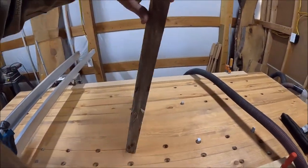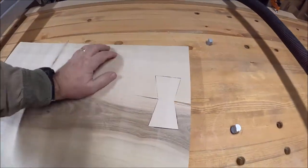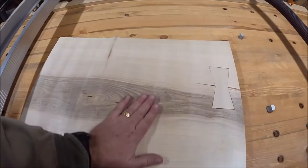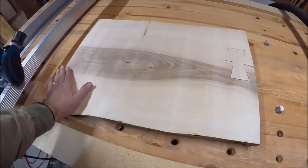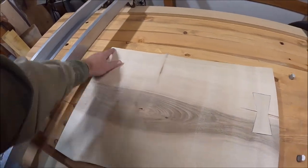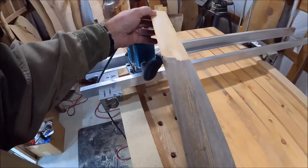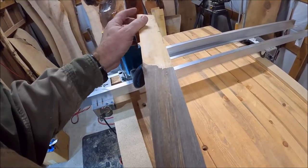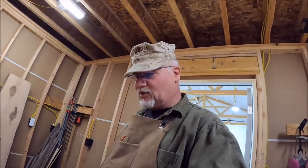That's a nice piece. I'm not sure which side — I think this is the side we're going to use because it's got more figure and it's got the bow tie. You can see what I was talking about — a little bit of a crack around it, but that's okay, we're going to fill that with sawdust and glue. We'll put some more glue in here, let it tack up, and sand some sawdust in there. Then I just have to cut one side to leave the live edge, and I'll probably round this end off a little bit and match that live edge. I take a 40 grit grinder and work around it, keeping the live edge as best I can, and take that point off. We also have to peel all that inner bark off.